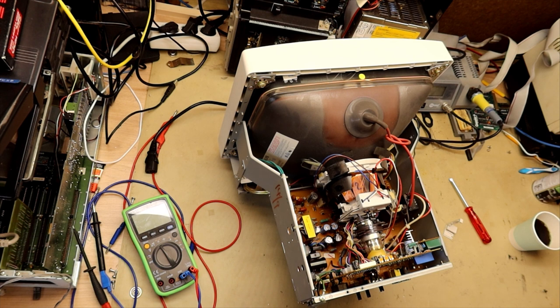If there is a capacitor that fails short, it would probably smoke and make a havoc. And if there was an active component like a diode or a transistor that fails short, it also tends to get very hot and smoke and take out the fuse. But resistors often fail open, so there could be some of that. There could also be other issues with the switching regulator, such as the regulator not starting.